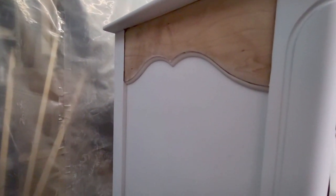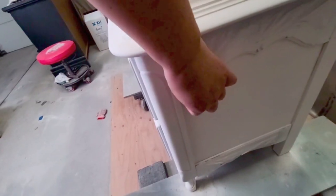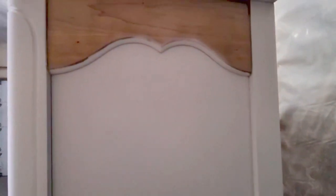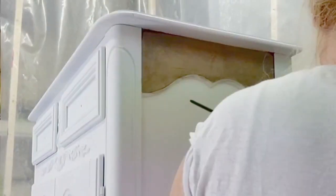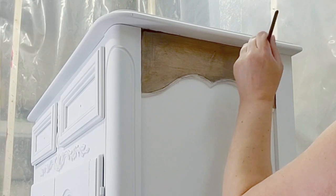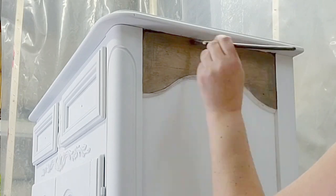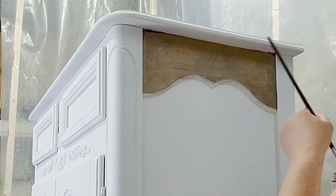Here comes the really cool and satisfying part — peeling off that plastic painter's tape. You can see there's a bit of dark stain left, and what I did was sand that off with the detail sander so it all disappeared. There was a little bit left but I was okay with that since this is my dresser. Now with the raw wood exposed and the piece all painted, I used Country Chic Paint Glaze in Slate, which is a gray glaze color. I like to use the glazes as a stain because it doesn't smell, it looks like stain, and it dries really fast.